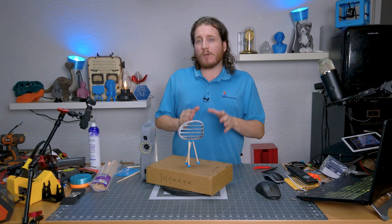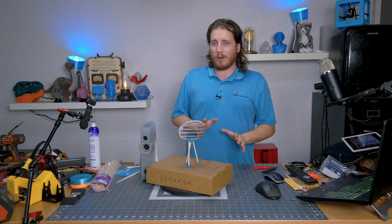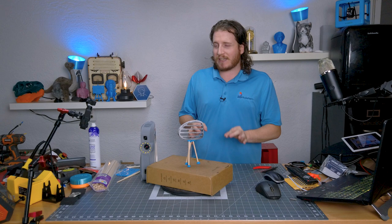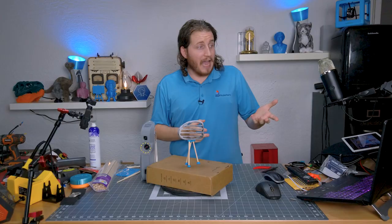This scanner runs about $20,000 US and is capable of detail down to 0.1 millimeter while capturing both texture and geometric detail. Honestly, I've never had the scanner get down to 0.1 — I run somewhere in the 0.3 to 0.6 range when I'm getting a good scan, and that is not great for its price point. That's why we want to dig into these 3D scanners: am I doing something wrong? Maybe.